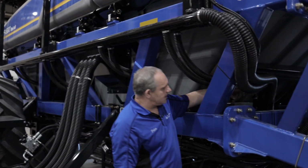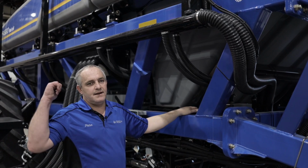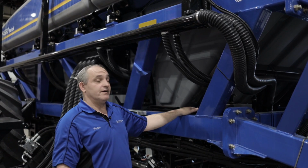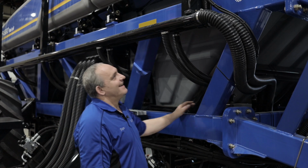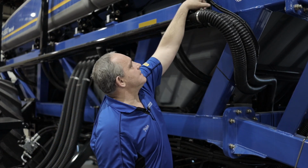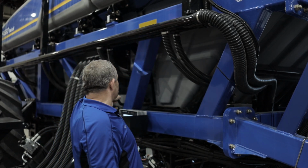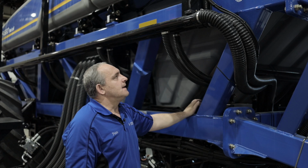So in the front here, you can see our ECU for the camera. On this unit, we've got 5 cameras, 1 in each tank, and a backup camera as well, or a rear-facing camera, I would say. This tank's equipped with scales. So there's our load cells up there. The bigger tanks got 4 cells each, and then our auxiliary tanks got 3 cells.